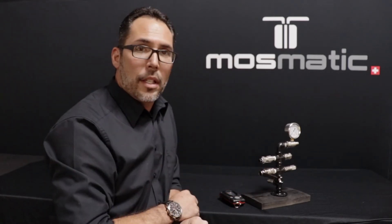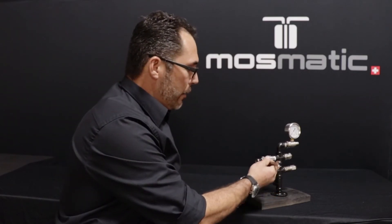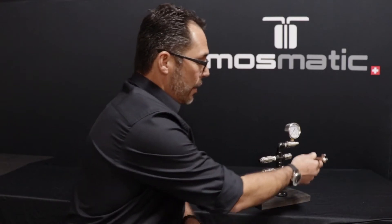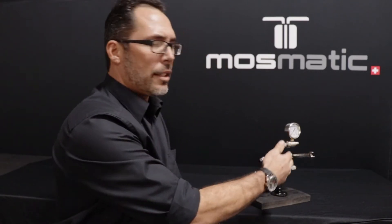As you see, this one's going to sit here without any weight — it's not moving. Moving up to another competitive unit, setting it horizontally, you'll see it has a slow fall, which means it has less friction at zero pressure. The next unit, a little smaller in build, has about the same speed of fall, so it's a little bit of a tighter unit.